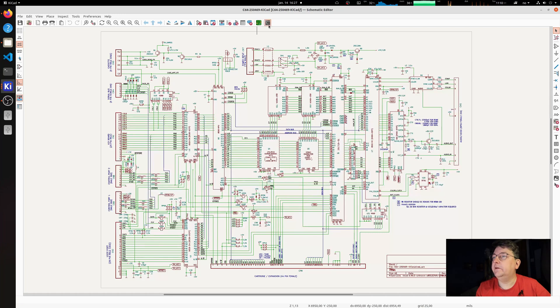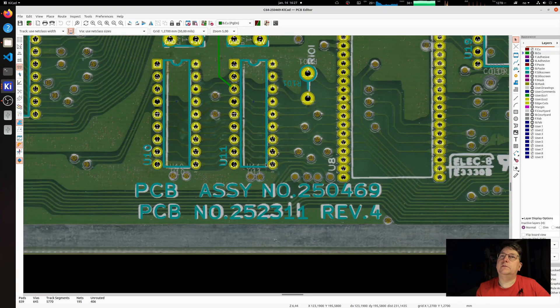I'm not sure what I did in the previous video, but this is the state of the schematic — it's pretty much done. We need some more descriptions on the right side. We have connected everything. One thing I want to talk about is the color RAM. I am on version 4 of the schematic. I wasn't sure what was correct because it's really badly documented. I think maybe someone in the comments can tell me if a super PLA can be used on a board that doesn't have the PLA externally. There was a revision B which is the latest one — I didn't know that revision 4 was not the latest.